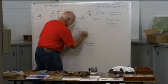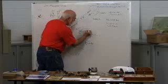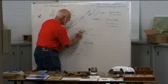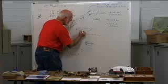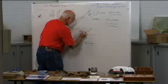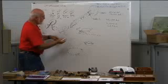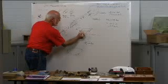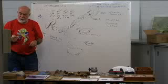So why not make something graceful like that, where the curve and the strength of the blade is confirmed all the way up there, because it starts thin here but gradually gets thicker and thicker. So you've got all this beautiful strength built into the blade, and you've also got that little bit of springiness that I was talking about earlier when you want to just flick that last little burr out of the way.